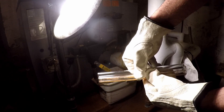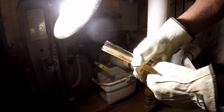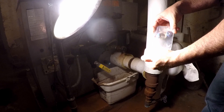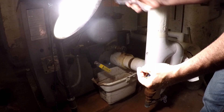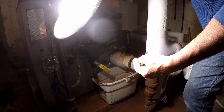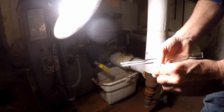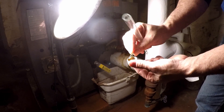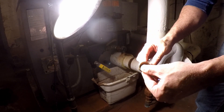Checking it to length again. I probably could have reused the old sight glass, but I also ordered the nuts and the washers — mine's five-eighths, so I ordered five-eighths washers and nuts. They're just like a pressure fitting on there. I had never done this before, so I wanted to get all my supplies ahead of time. This is winter right now, so I wanted to make sure I wouldn't be out of heat.